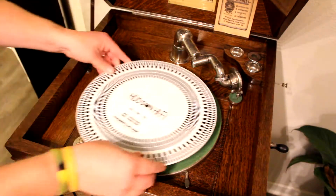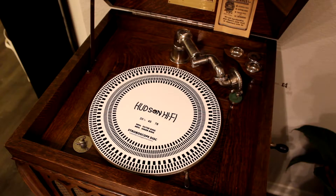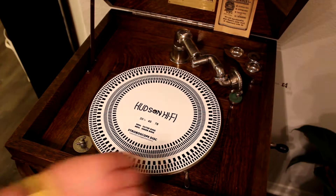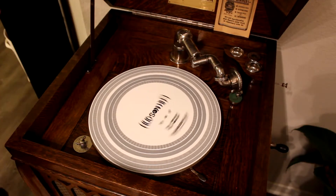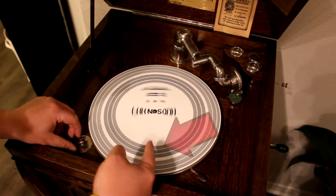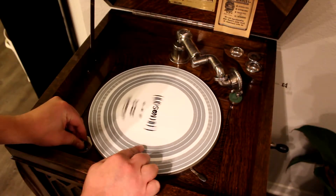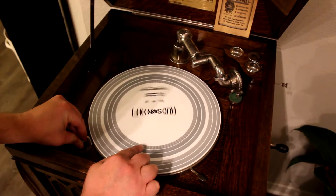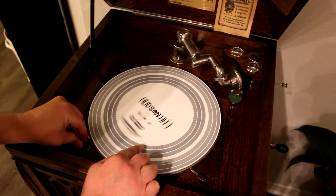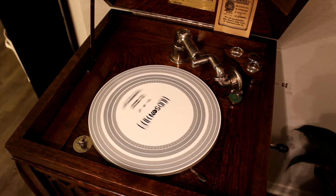All of these things will go into giving you the best audio experience possible from your new turntable. We can even use a strobe disc to set the appropriate speed on this 100-year-old phonograph. Let's go ahead and crank her up. We should be seeing 78 RPM in the center right there, so we're going to adjust the speed until those marks right there are stationary. Right about there — it's really hard to set on these ones. Right about there. So there we go — about 78 RPM right in the center.